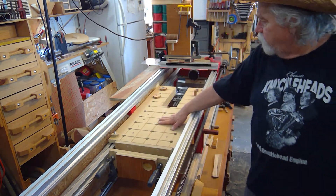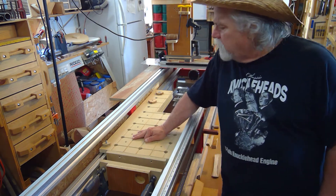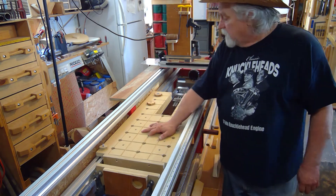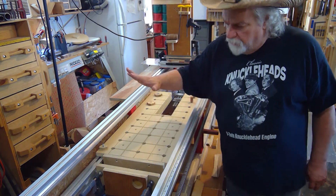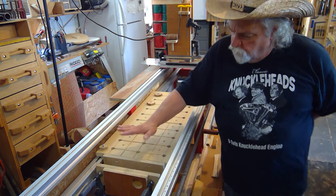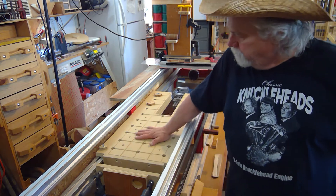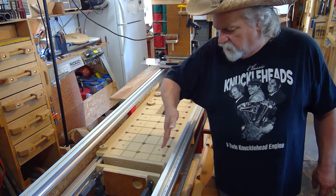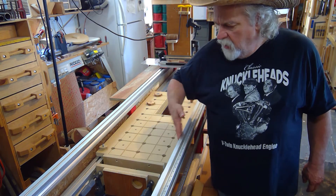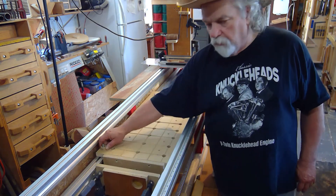When you're doing flat milling as opposed to center turning, a good work surface — and I've gone through several different ones — this is my latest one. I've been using it for probably close to a year now and I like it the way it is. This is three pieces of plywood: two MDF pieces and one regular cabinet-grade three-quarter-inch plywood, sandwiched together. The two lower pieces are the width between the table rails, and this upper piece widens the fit. So it sits on top of the table, held in place by gravity and a couple of quick-turn knobs.